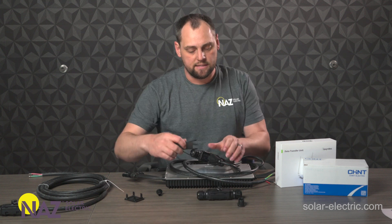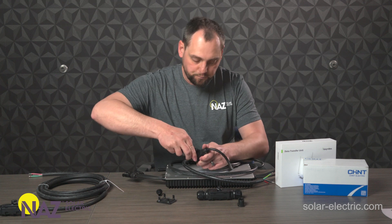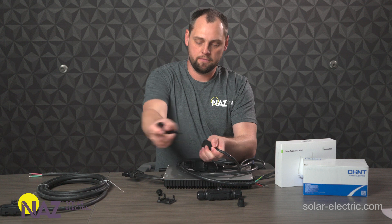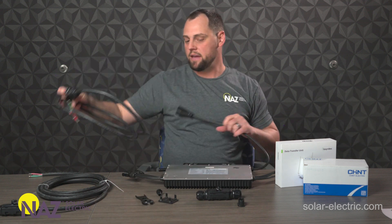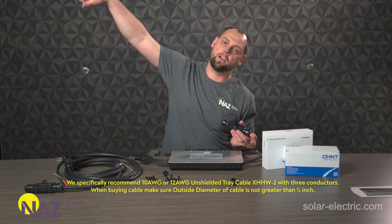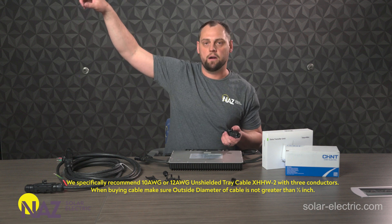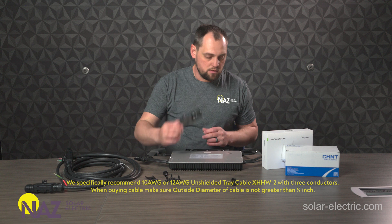You can disconnect — you've got disconnect tools and tools for opening up the junction box here. And if you want to make your own trunk cable, you can buy just the connectors, get some SO wire, and basically make up your own lengths however much you want. If you're running one group of modules — four, two modules, or whatever — off way over there and you need to make a custom length, you can do that. It's pretty easy.